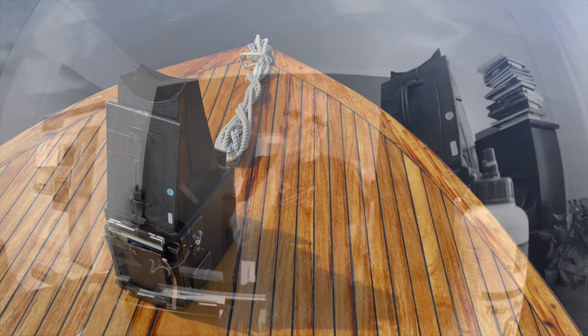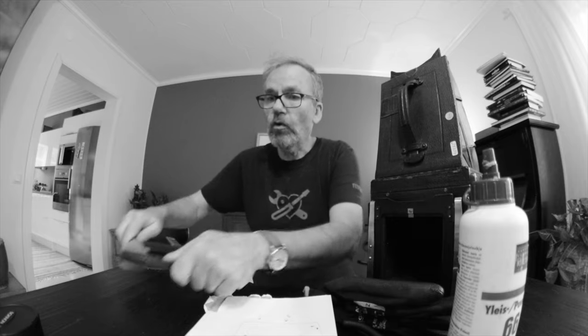By the way, I lied a little when I said only a small flathead screwdriver was needed to fix this. I also needed some wood glue — this is made of mahogany, I figured that out, the same material as my boat so they go nicely together. I glued some things, used the rubber glove as already explained, pliers to twist the metal parts of the curtain a little bit, a match to get glue in the right places, and one more tool I don't even know the name of in English. So I mean, these are proper camera mechanic tools. I fixed my Graflex — I'm so excited!